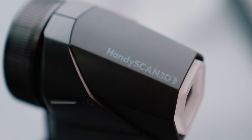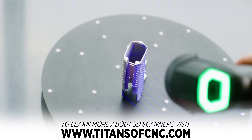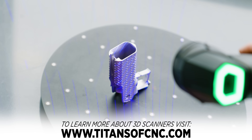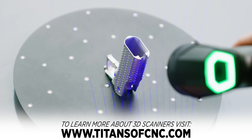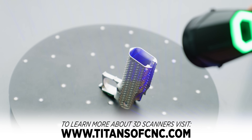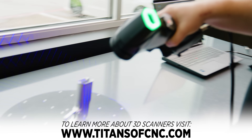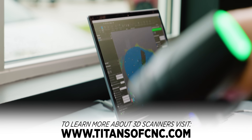The first question everyone has with scanners like these is how accurate are they? This scanner is ISO certified and it's accurate down to nine tenths. That's pretty insane — I would have never guessed they were that accurate. There's also a limited model that's accurate down to half a thou, or five tenths. And this thing is incredibly fast — it takes 1.8 million points per second.